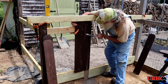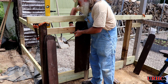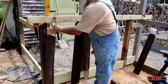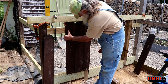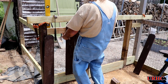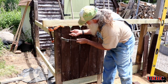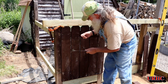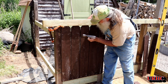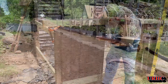I used two-and-a-half inch blue coat screws for outside with that Kreg R3 jig, and that makes it really easy to put fencing parts together. The Kreg screws really do hold up well for stuff like that — it's a quick job getting everything mounted together. I got the posts in, and these are the boards I'm recycling from up above. I clamped a two-by-four across the top to have a nice surface to butt them all up against so they'll be straight. You can see they're definitely a little under four feet overall, so it is definitely getting short in this area.